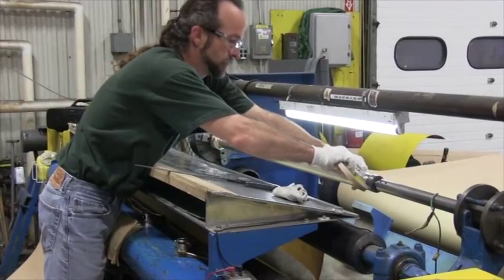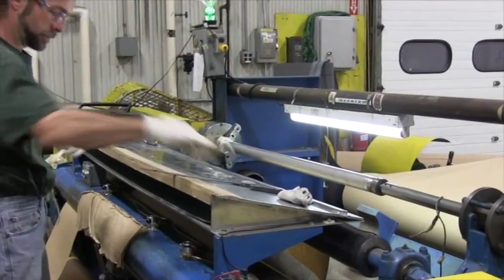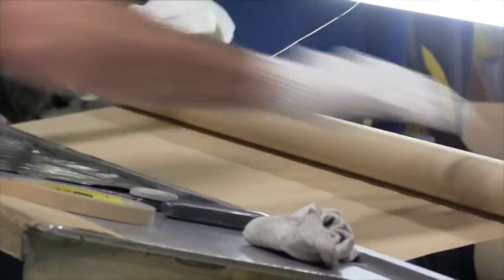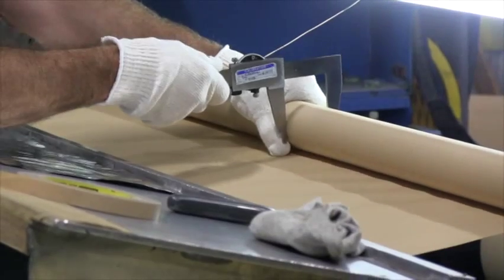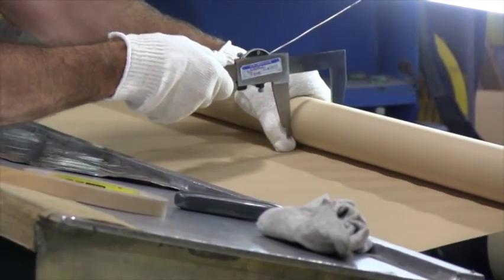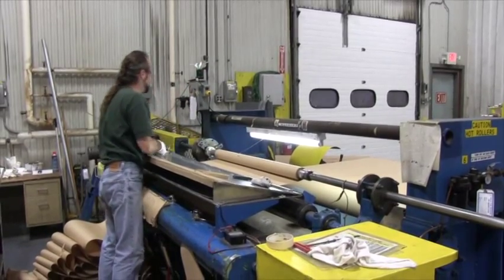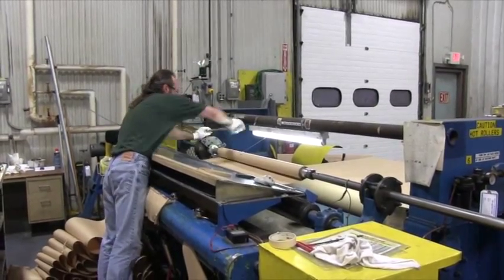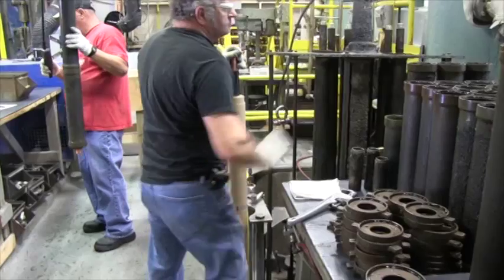A paper resin capacitor core, or PRC core, is very similar to a POC core, with the only difference being the paper and foil types. PRC cores utilize a crepe paper, which ultimately expedites the resin impregnation process, and a coated foil, which more effectively bonds to the resin.